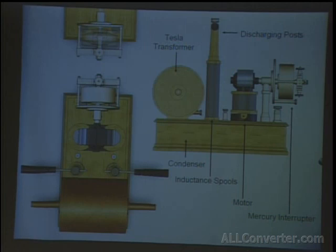There's a fan, the blades of the fan, that's allowed to move freely. It's on a fixed shaft so that the whole assembly doesn't move. But as this cylinder is spinning, it's catching the blades and spinning the blades. And the blades periodically make and break contact with the mercury that's on the outside of the can. So that's what's making and breaking the circuit.